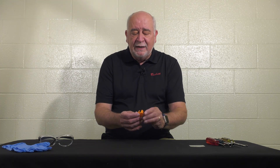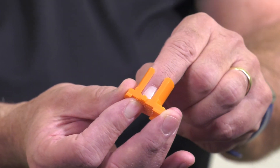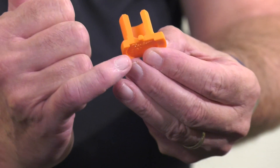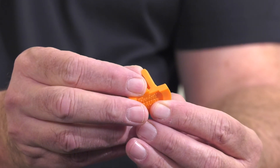The Z2000 gauge is a go/no-go gauge that is slipped over the nozzle. You will see that it has an opening where the nozzle will stop. This tab in the front is the positioner for the electrode setting that will give you the gap and the position forward.